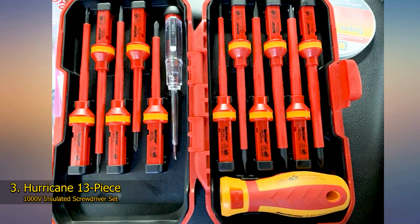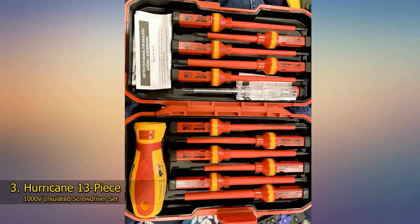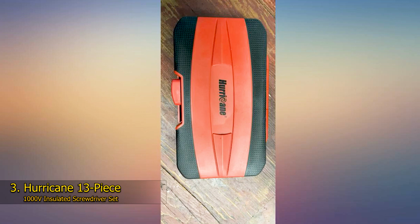We also used these screwdrivers for electrical and support screws while installing several outdoor ceiling fans. The magnetic bit tips conveniently stuck to lightweight electrical junction box screws to prevent drops, but heavier exterior wood screws dropped off. The voltage probe worked to detect live outlets by simply inserting the tip into the outlet while covering the rear contact plate with the thumb.